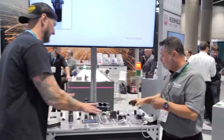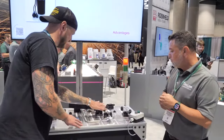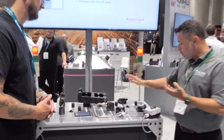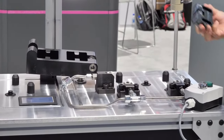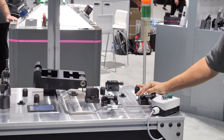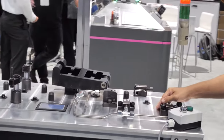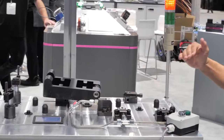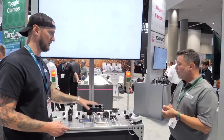We have a little demo for that setup, but before we do, let me show you what we're looking at back here — I see some kind of pins and something that looks like a button. In this setup we have three products: along with our pivoting edge clamp, we have our alignment pins — three of them — and we have our air rest buttons that allow the operator to confirm whether the product is properly nested or secured in its place. That's not only for safety, but for making sure the part's going to run right.